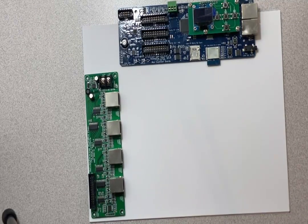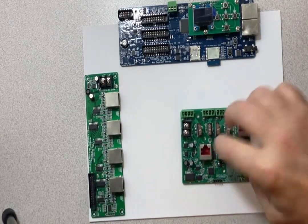So what is smart technology about? Smart technology allows you to put more than one board coming off of a Cat5 data stream. HolidayCoro's implementation of smart long-range technology allows you to put 16 boards coming off of one Cat5 cable. And the distance between any one smart long-range receiver is anywhere from 200 plus. I've tested 4 of them at 200 feet apiece, well over 800 feet between the HinksPix Pro and the last long-range smart receiver. So, real quick, this is a long-range smart receiver.